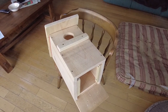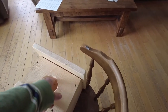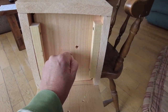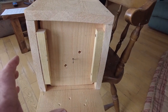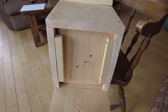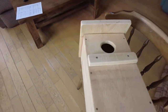I hope this gives you some ideas about how to build your screech owl box or redesign it to your preference. The key things are getting the hole size right — approximately 3 inches in diameter — and the floor area for a screech owl should be anywhere from 7 or 8 inches square up to 10 inches square. Some internet plans show a very long narrow box, and while owls have used those, the interior seems far too small. Personally I prefer a box of at least 7 by 7 inches, since in nature they won't typically be in cavities much bigger than that anyway.